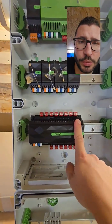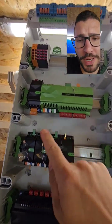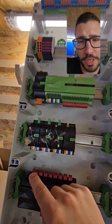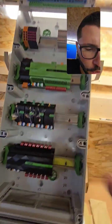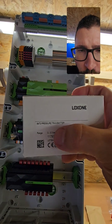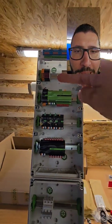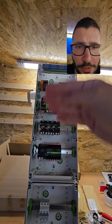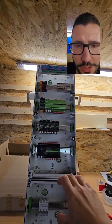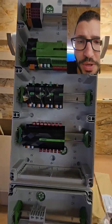There's a relay extension for more outputs, because with the garden watering there are several circuits, and there is a circuit for the filter pump. For the magnetic valve to refill the water level, there is a zero-to-10 volt sensor, zero to 0.3 bar, for the water height. So there is no float switch — just a pressure sensor installed at the very bottom of the pool, and then you know exactly the weight of the water above.